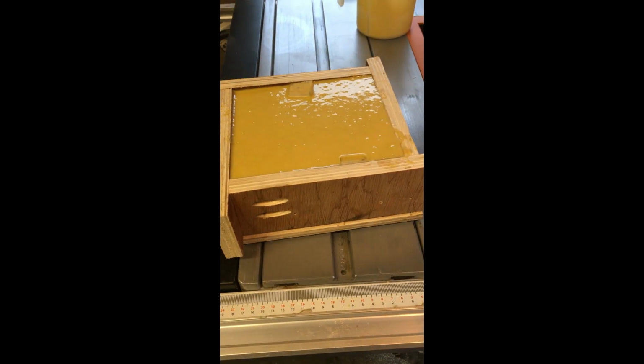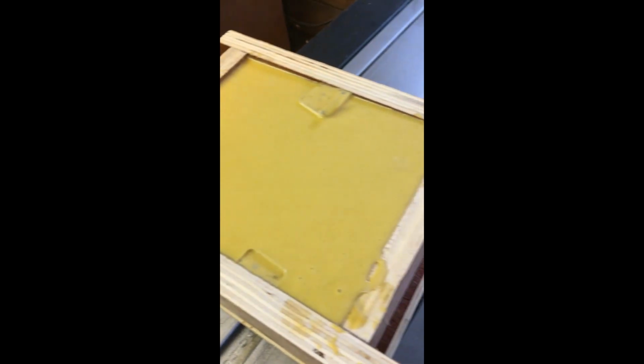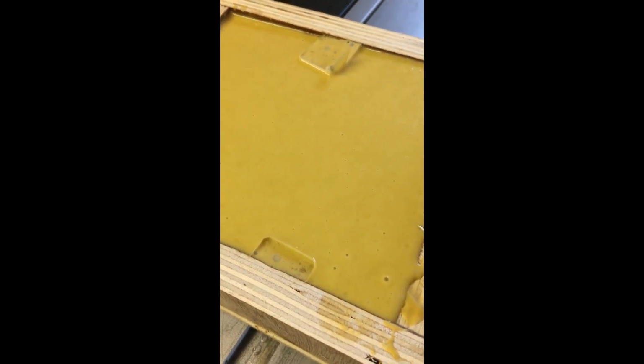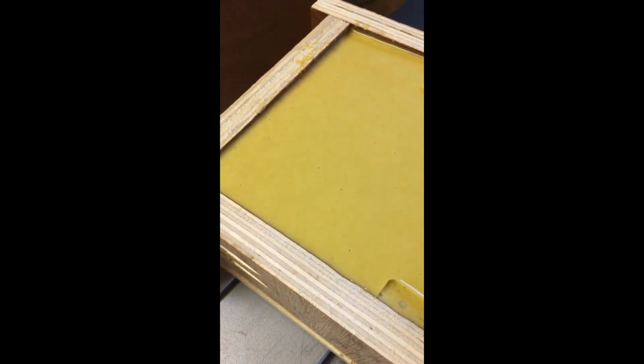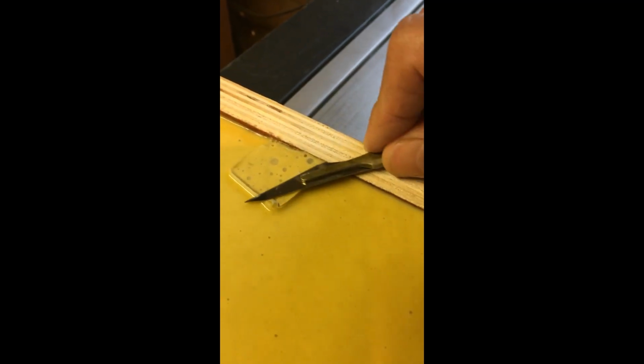Okay, so my mould is now cured. I'm actually going to leave it a little bit longer before I separate it, but I just wanted to show you one of the beauties of this rubber stuff. It is expensive, but look at this. I can shave it with a scalpel and basically carve and peel away the bits. Oh, you can't see that. I'm rubbish at this. So the beauty of it is it's very, very easy to cut with this very sharp scalpel blade. I don't know if you can see that. Yeah, it's very hard to do this with a phone and a knife in one hand.